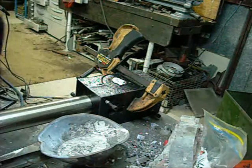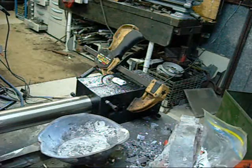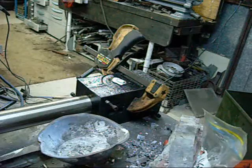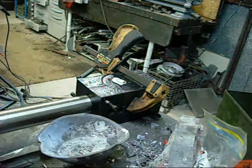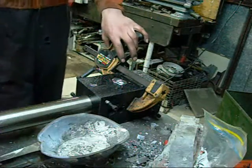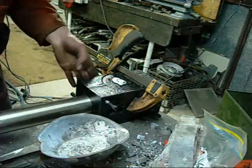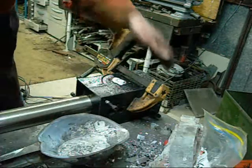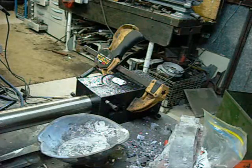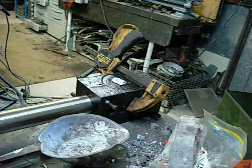That's number 3. We've got plenty left over — it's always good to have excess material, not under-material. This stuff cools off pretty quick, so crack it open almost straight away, although a lot of heat gets into the die so I'll give it a bit longer. As always, have a good ventilation fan on when you're working with lead — the oxides that come up aren't very nice.